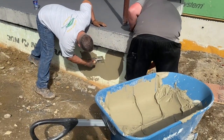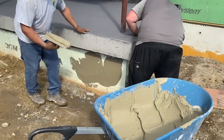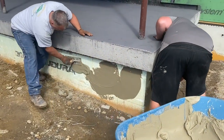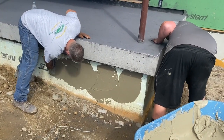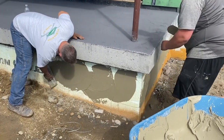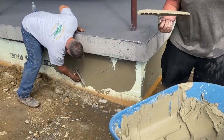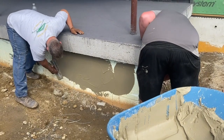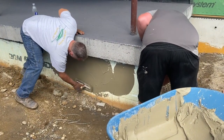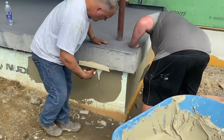It's easier to put it all on and then spread yourself out there. You can spread it out, let it harden up a little bit. I'm going to grab a wad like that and just put it on there, then you can kind of spread it out after. I'm just doing a couple walls at a time, depending on how big they are, and then going back through after. You don't need to put this first coat on real thick — just enough to get that mesh in there. It works better if it's kind of thick though.